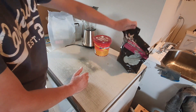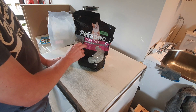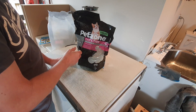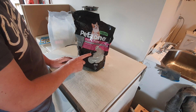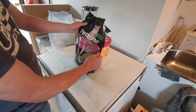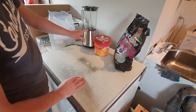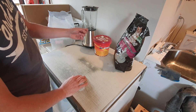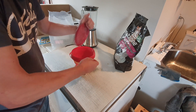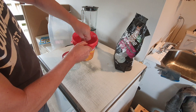To mix that we have to use a clumping agent so the sand combines. The most common thing people use for this type of setup is bentonite clay. To source that you could go to a farmland shop, or you can buy bentonite cat litter. It's a granular consistency, so we need to liquidize and grind it up into a fine dust, which I've done. It's really fine, all ground up, and I've sieved that as well.